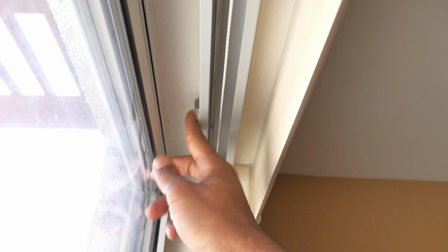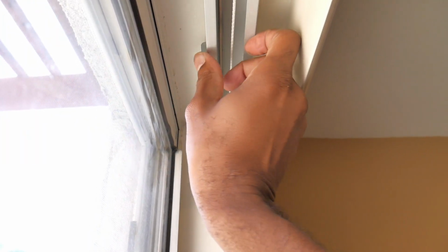Okay, I'm back from Home Depot and I have my blinds. Now it's time to take down the verticals, and all you have to do is get a screwdriver or use your finger and push the clips, and these slide right out. As soon as I take them down, you'll see exactly what I'm talking about. Right here is one of the clips. You push it and then this just slides. You might have 3 of them. I only have 2.